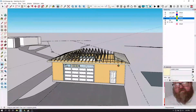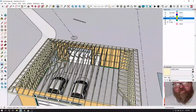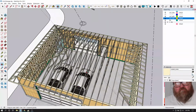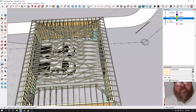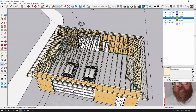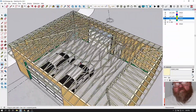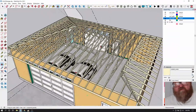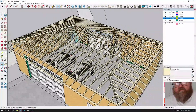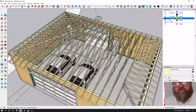And it's been a little bit of a booger doing the roof on this thing because it's a 32-foot span. And actually, the span inside, in between the walls, is a little less. It's what, 31'5", I guess. But still, you have a hard time with dimension lumber spanning it that far. I even checked the span tables for LSLs, laminated lumber, and they weren't happy about the 32 feet either.